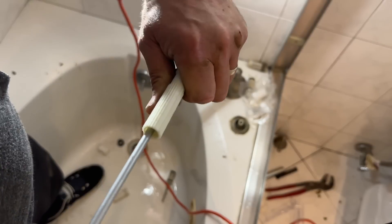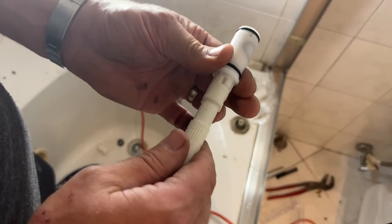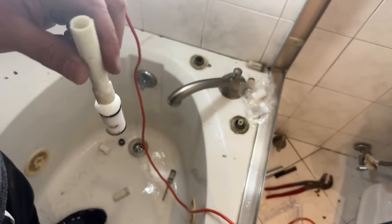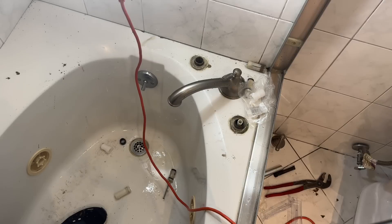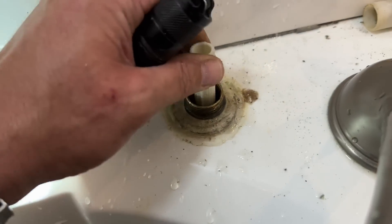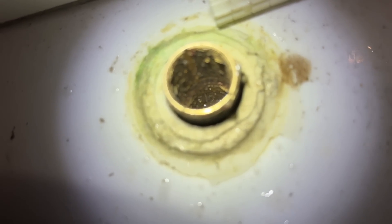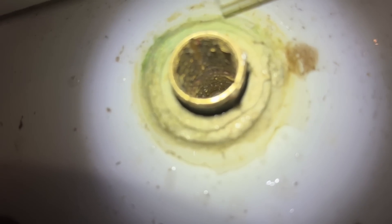It's always a fun challenge when you're trying to get it done while your wife and kids are yelling, 'Daddy, when is the water going to be back on?' Shoemaker's kid has no shoes — I kid you not. Now that this is attached and I cleaned out the body for the hot water, let's see if we can get this in there. There should be notches right where the cartridge is going to fit — there's one notch there and another one there, but we need to line that up and get it in the hole. I'm going to use this as a plunger trying to get all that water out of there, but she's not working. I'm going to get a straw and suck up some of that water.